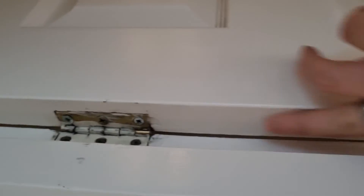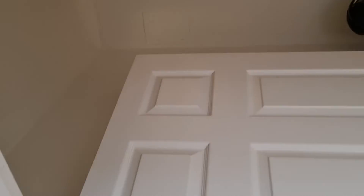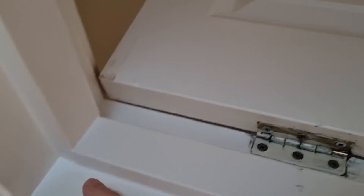So to recap: cut behind the door frames, cut the bottom of the doors so when you roll you don't get paint on the dust sheets. Cut the corners, then across, then use the roller around the edges and the back of the panels, and roll the rest.